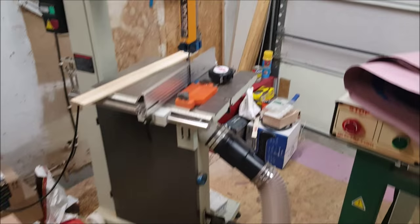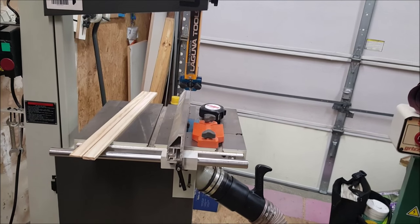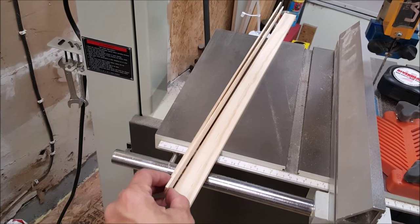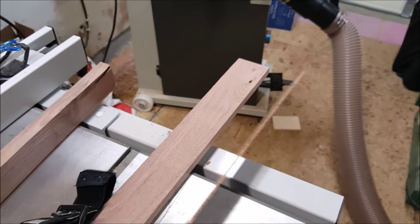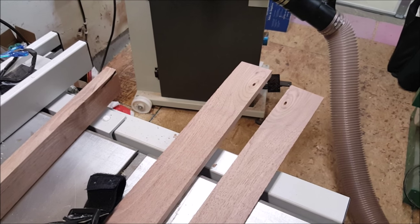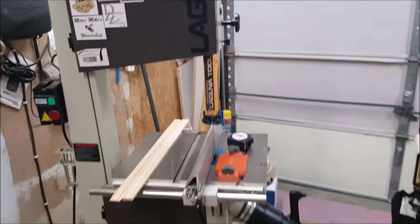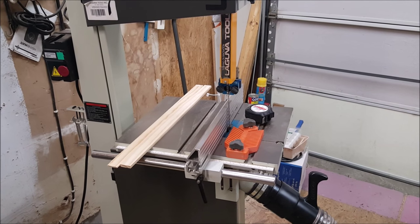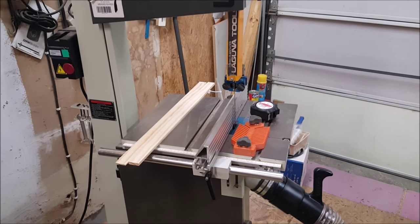Over here you'll see the band saw has been rotated. That wheel basically hasn't moved and I've taken it and spun it out because I'm doing some re-sawing. See how close the blade is. I did some practice pieces before — a couple little eighth-inch slots there, that's just pine. And here is an eighth-inch piece of walnut. So it's working very well, and that's with really no setup. It has the Wood Slicer Highland Woodworking blade on it and it seems to do a very nice job. The saw just tracks beautifully.